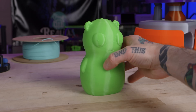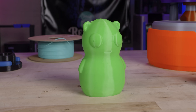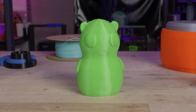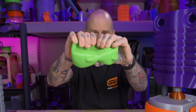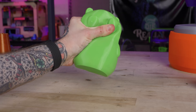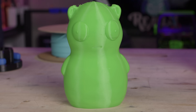The last flexible I printed was this adorable little kuchikopi from Thin Air 3D. I used NinjaFlex 85A TPU — two perimeters, 4% gyroid infill — and you can really squeeze this thing down to almost nothing. This NinjaFlex material has given multiple of my machines a hard time in the past, and the Neptune 3 Max's extruder just handled it like a champ.